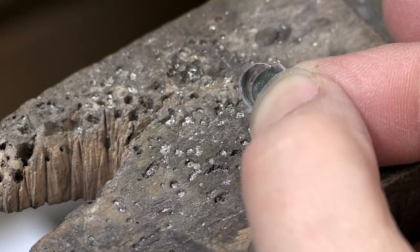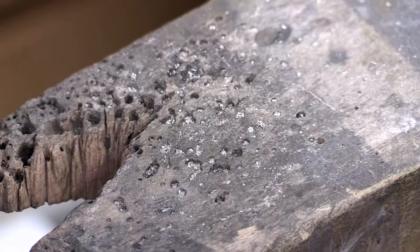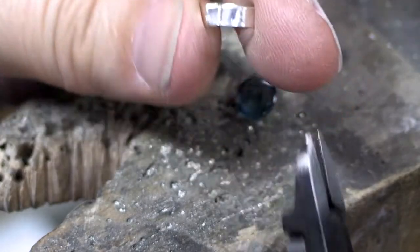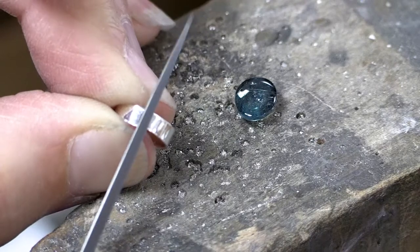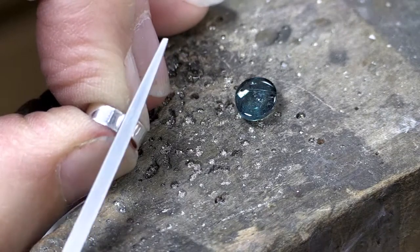Against a dark background it's going to be harder to see - white will really give you a much more graphic representation. Cabochons are slippery, I drop them all the time. So make sure you move the tools out from underneath your bench pin because you really don't want to damage your gemstone by dropping it on a piece of steel file. You can saw it, you can snip it, whatever you like. But once you do that you need to take a file and straighten up and flatten that end before you solder it so that they meet nicely.